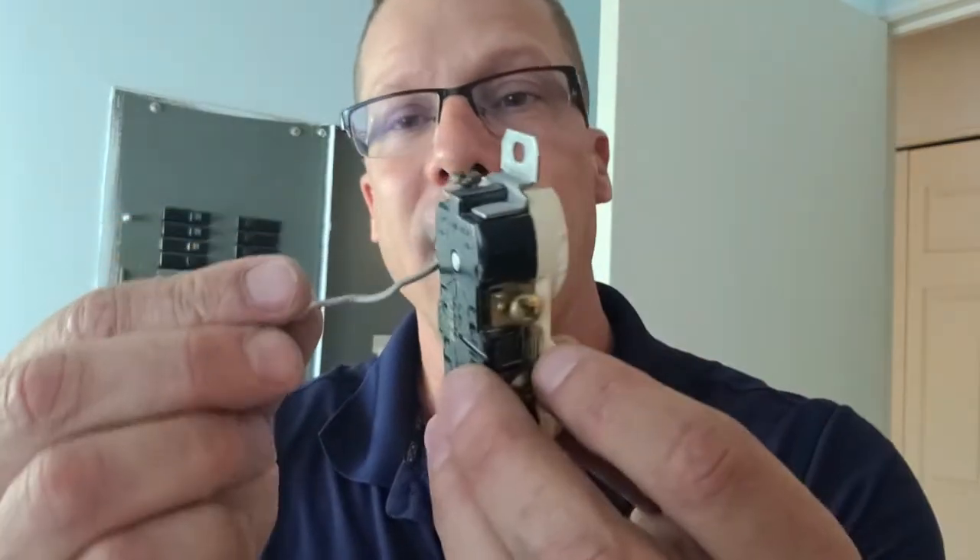What's happening is that whenever you have a piece of aluminum that is inside an outlet like this here, with heat — whenever it heats up and it cools down, it expands and retracts, and eventually it comes loose. And when it comes loose, it can start arcing and boom — fire.